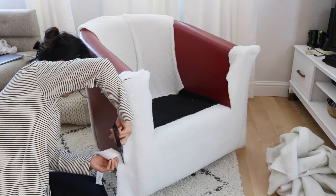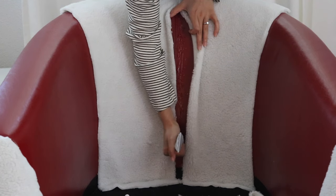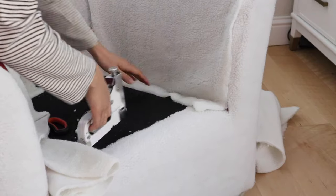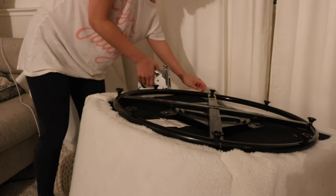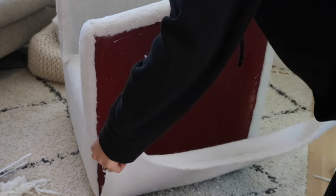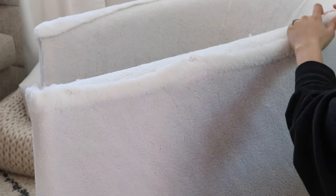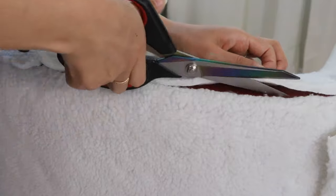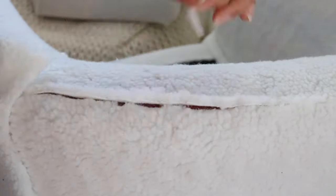I let these pieces dry overnight, and then the next day I trimmed and glued on the edges to make it easier to have the edges be flush later on. I then attached the side panels and finished the rest of the cushion. Once the pieces had cured, I flipped the chair over to staple on the last exterior side panels. The next day I cleaned up some edges and glued the last side panels on, pulling outwards and upwards and pinning them to the top so they could stay as tight as possible as they dried. I learned over time that it helps to angle the scissors when cutting the fabric so that the fuzzy part doesn't get cut off, because the fur does help cover those edge lines.